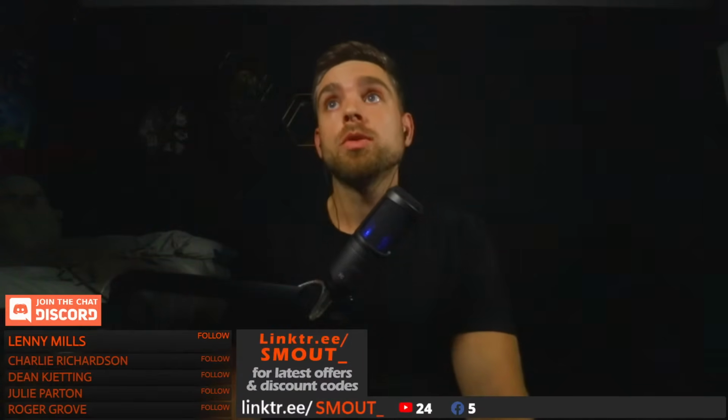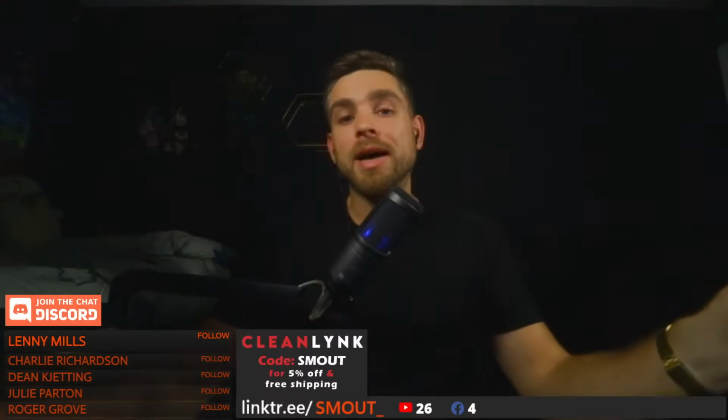Jed, welcome. Tracy, welcome. Hunts. Andy, what is the best setup to clean gutters, soffits and fascias? Are you asking me, or is that a question for Craig when he comes in? Because in my opinion, we've just been using our resin tank, water-fed pole, pure water or deionized water anyway. Is it deionized? Deionization? Have I got that right? We've been starting with the pure water to see what sort of results we get, and if there is any staining, then we've been going in with either some Synergy or TFR. But you'll be surprised how well just water works.